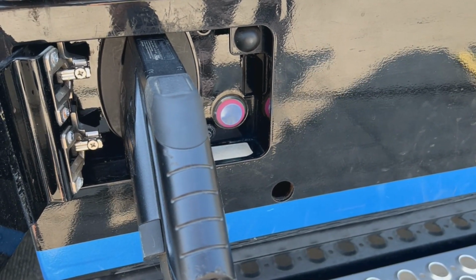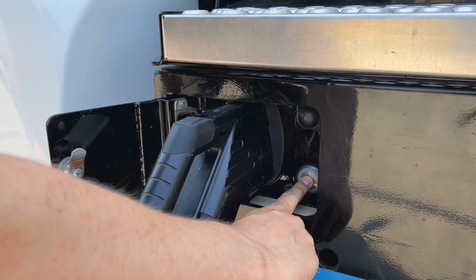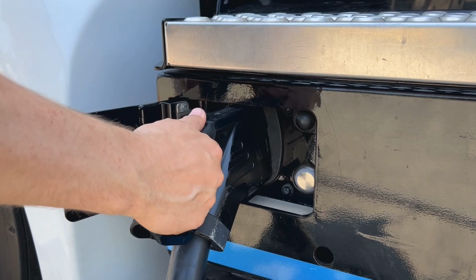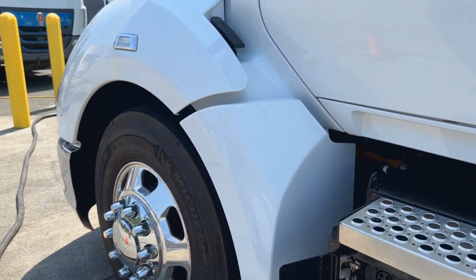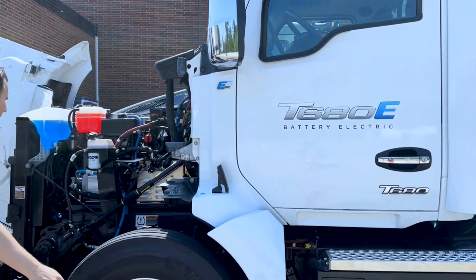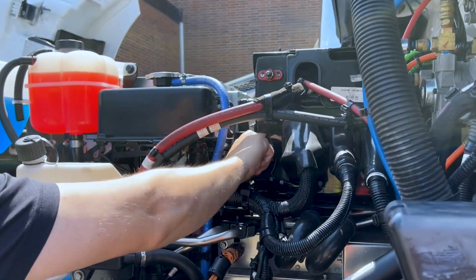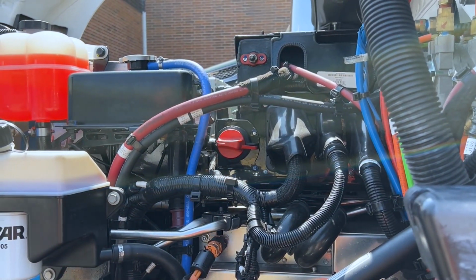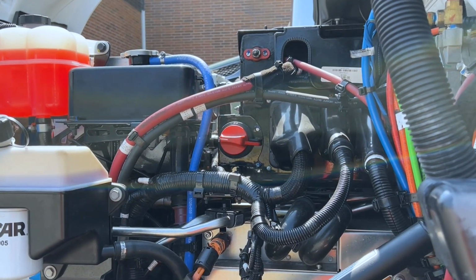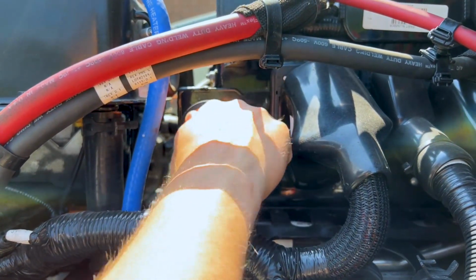In the event of a charging error, disconnect from the charger. Touch the sensor and you can remove the plug when you hear the charger release. After the charger is disconnected, wait about 30 seconds and flip the 12-volt disconnect, which is located under the hood on the driver's side of the PCAS system. After 1 minute, flip the 12-volt disconnect back to the on position and reconnect to the charger.